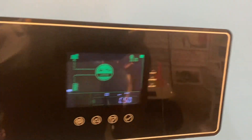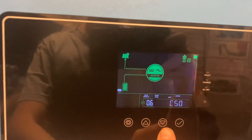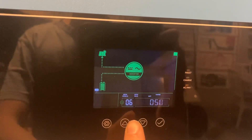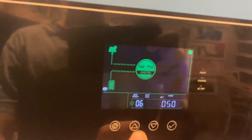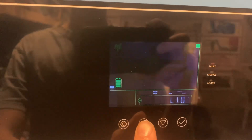I'll go ahead and put that back, select the setting, and go back to OSO mode. OSO mode means only solar charging for the battery. Battery type is another important setting — for these wall mount units I'm using the L16 setting, which is lithium iron phosphate, representing 16 batteries in a series.